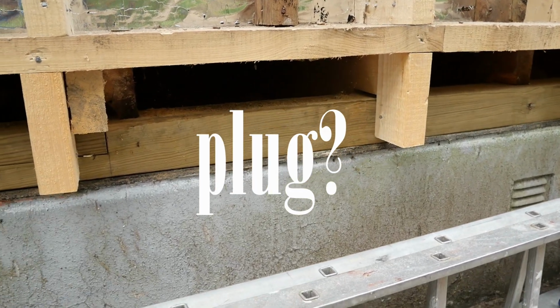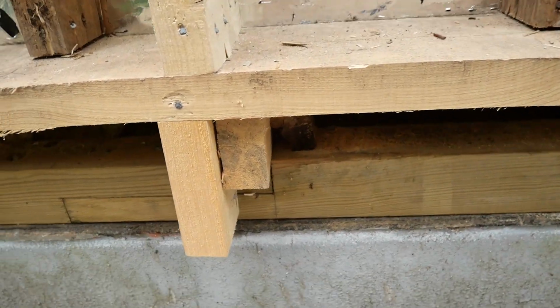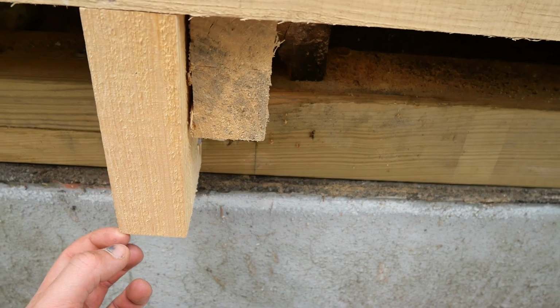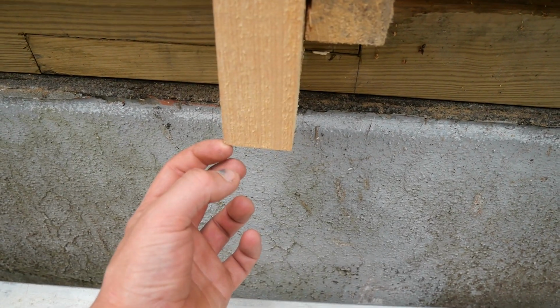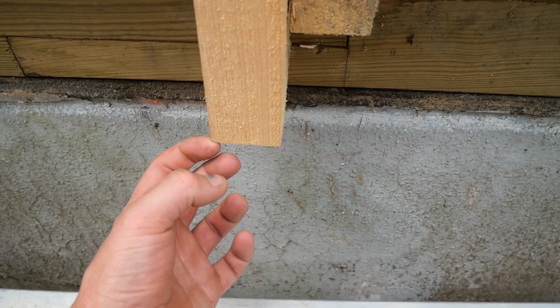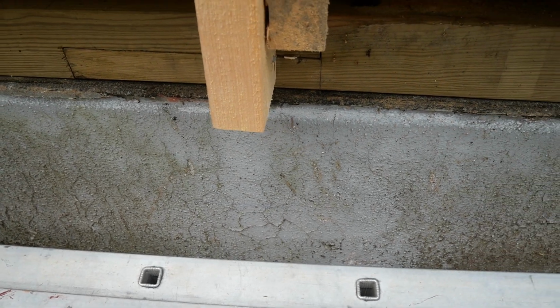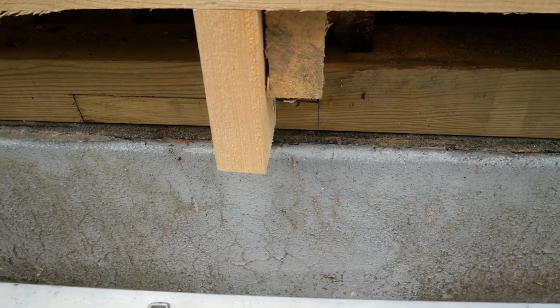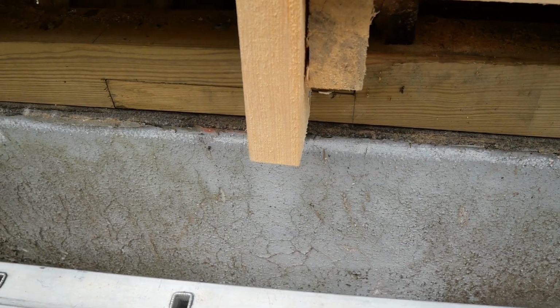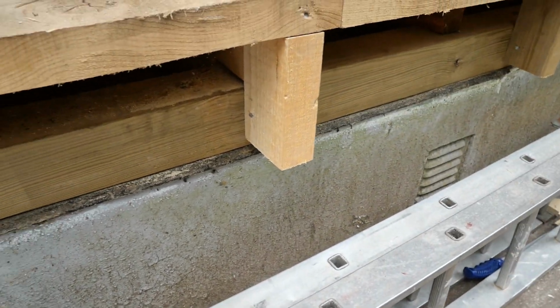The bottom plate is 6 inches and it has to stick out the thickness of the asphalt plate, right, plus the thickness of the furring, the first layer of the furring, because I wanted to cover that. So it should be good to go soon. It must be ripped probably a little bit, but not much. So let's check what's the thickness of those two, and maybe just start there, fasten that to the wall so we can put some insulation in down here.